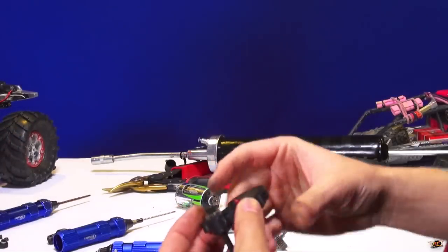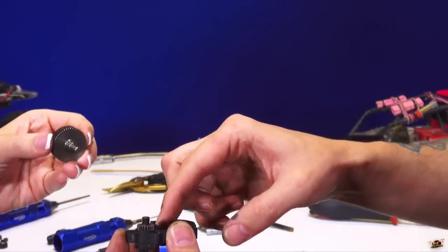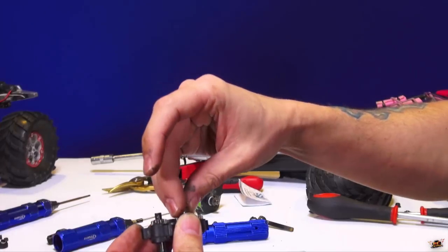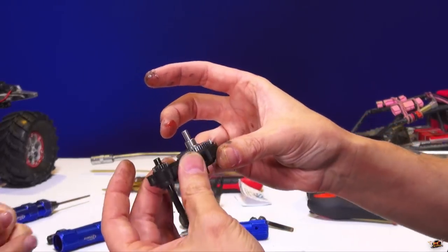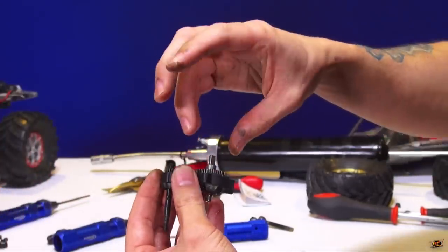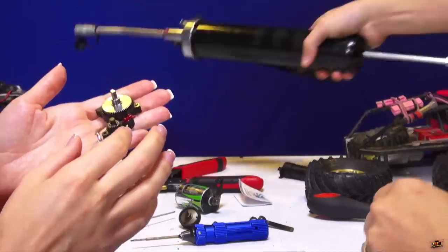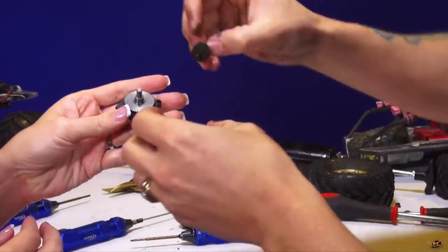That'll do fine. Okay. So back with the output drive. Doesn't matter which side. Just going to kind of slop it around there. So not too much grease, just a tad. Just enough to make it wet. If you put in too much grease, unfortunately, it doesn't function very well, right? It just gets gummed up, so it doesn't work very well. Just a bit. Okay, the bearings on the inside here actually feel pretty darn good.